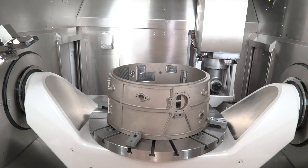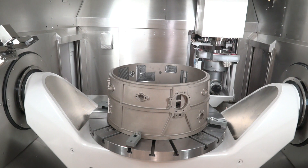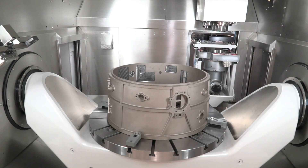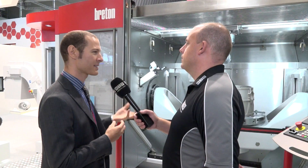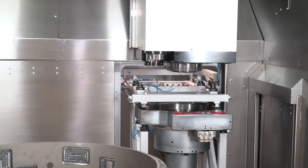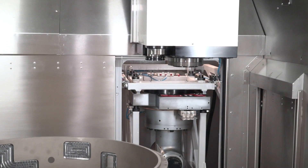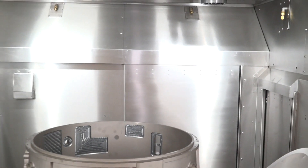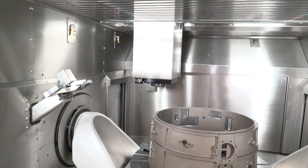Having a head changer — does that not make the spindle less rigid? No, because this machine has been designed for the aerospace market. Aerospace components are pieces where you need to go inside to do turning and milling. With small components you can't go there with a ram and a very small head because you'd lose rigidity. So you use a very strong design at the top, put a 90-degree reversal, and avoid the classical angular head clamped with the spindle. This way we can output 600 Newton-meters for this head.